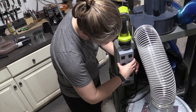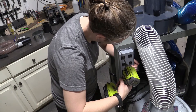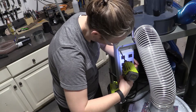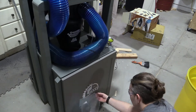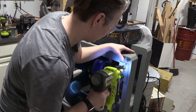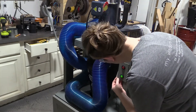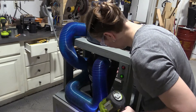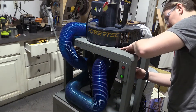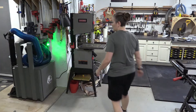The main reason why this power strip has so many outlets is because it was the only one I could find with a long cord, and I wanted that in case I do end up moving it around. It will also be nice to have the extra outlets on that side of the garage. I printed off a logo on my vinyl cutter, because why not? These LED lights fit really nicely into 1/8-inch Baltic birch — I just drilled a 3/4-inch hole and put the lights through. I decided to keep it simple, nail this to the front, add a piece of 1x4 right behind it, and then do another piece on the back side of the post, so it just forms a simple little box.